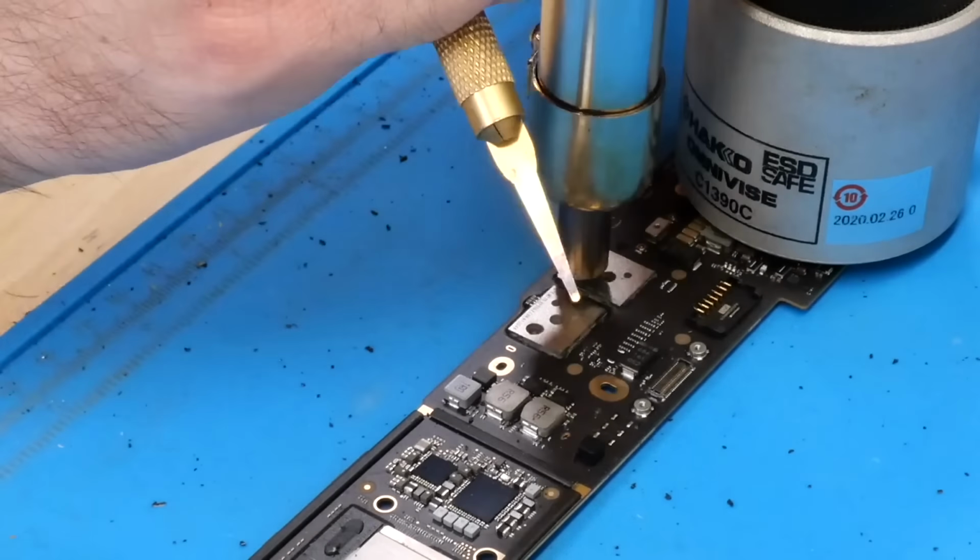So in order to do that, it's a quite complicated process. We have to take this SoC off the board, reball it, and solder it onto this board, which sounds easy in practice, but it is actually quite a bit difficult to reball these specific SoCs. I've actually got another one right here, and as you can see, the pin pitch and the pad diameter here is extremely small, which makes it a little bit difficult. But I have done so many times, and I think I should be able to do it no issue in this instance. So to begin that process, first we need to get this board on the board preheater and prepare to remove its original SoC.